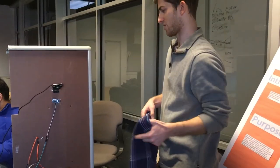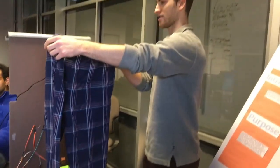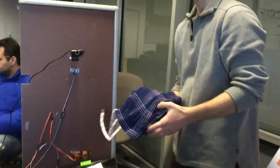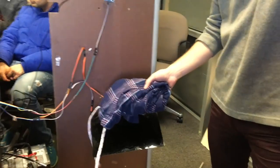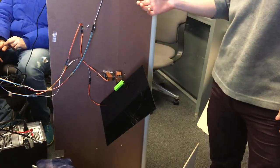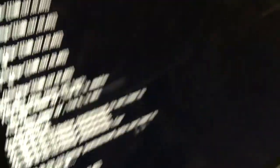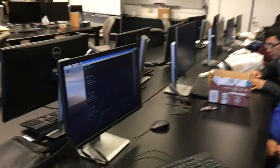Try with the second garment, trip the IR sensor, capture the picture, wait for it to get processed, and the laundry gets tipped into the correct hamper. Our server over here shows the feature vectors along with the classification from SVM.